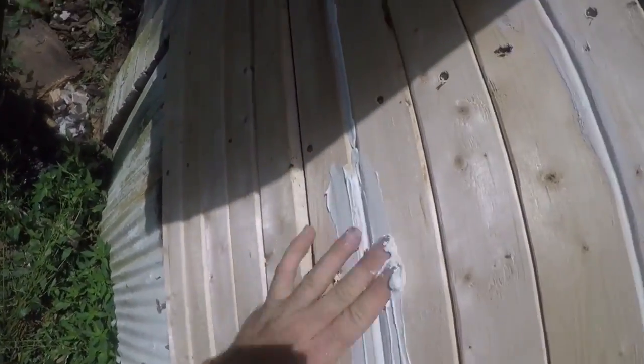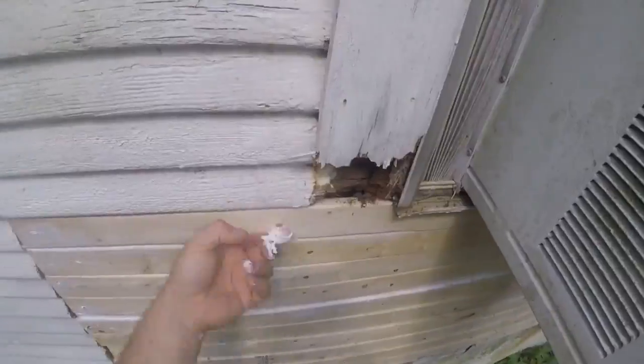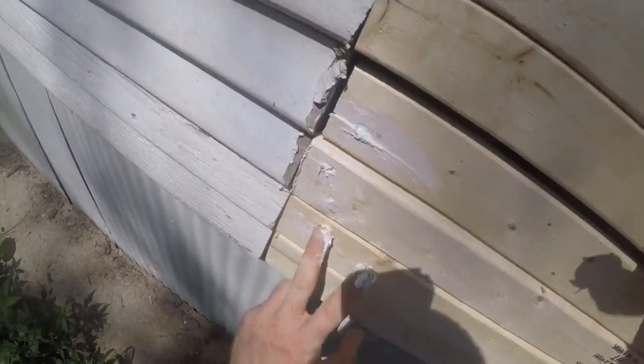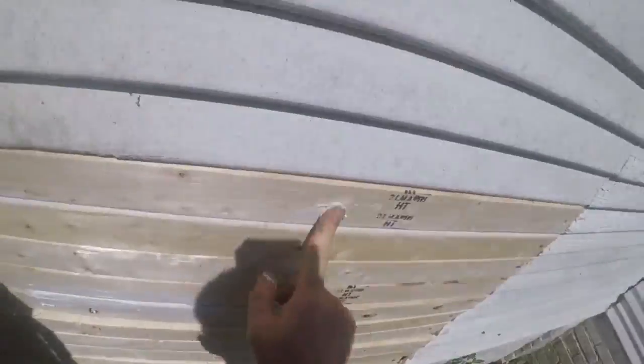I'm using it to weatherproof and bugproof the siding I just installed. I'm also using it to cover all screw holes and screws, even if they're flush with the wood. The reason I'm doing this is it's called painter's caulk for a reason. Caulking the screws will allow paint to adhere more effectively to their surface. It is aesthetically pleasing as well. Caulking wood will allow you to fill any gaps that would otherwise be an eyesore.